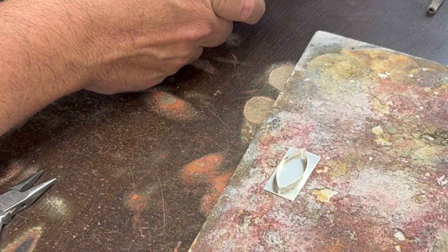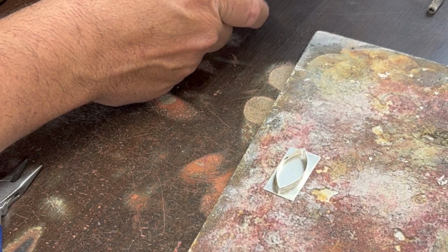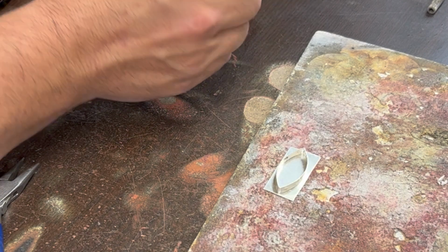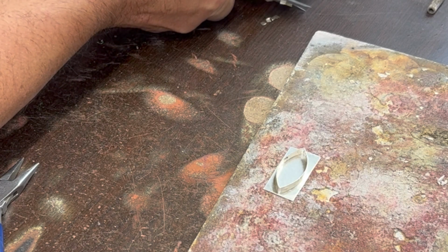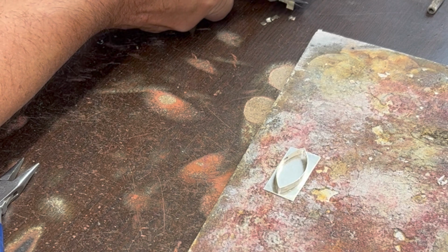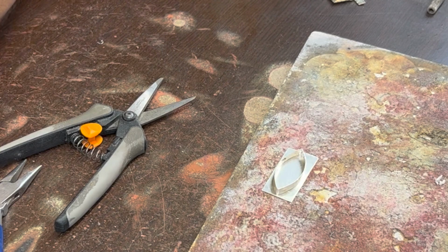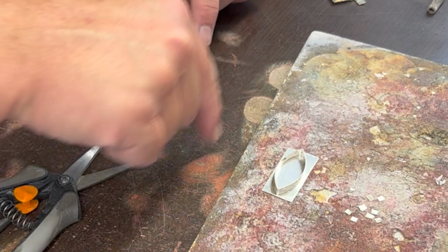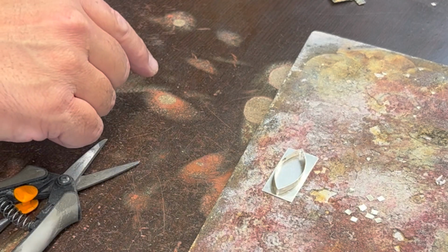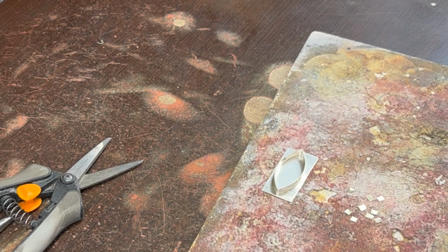I know a lot of people put like 20 little tiny pieces spread all the way around there, but from my experience, that is not necessary, because as long as you have contact on the bottom edge of that and you get the entire thing hot enough, it'll wick right along that whole seam pretty effectively. So you could theoretically put them all in one spot, but it's probably not a bad idea to spread them out either.